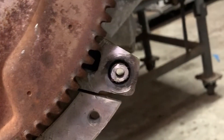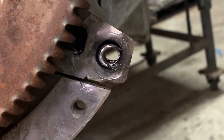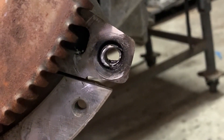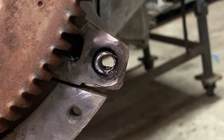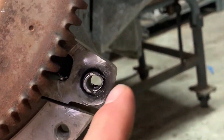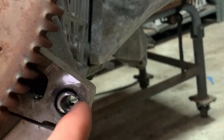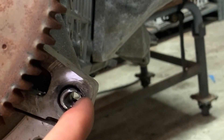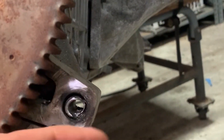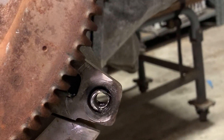There's our next step — I'm thinking about two more should do it. We're almost there, but as you can tell, it's just a little off center. That started with the pilot hole, and that's almost impossible to do dead on. But that actually works to my advantage because what I'll do is use the same drill bit and just wallow it back and forth and take out that edge. At that point, most of this material will be gone, and I can just knock it in and then pull out the rest, and that will expose just the threads.